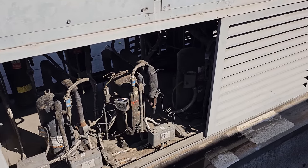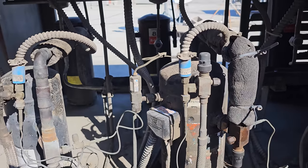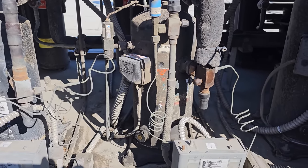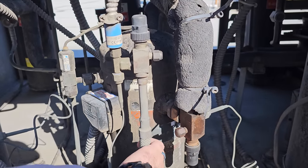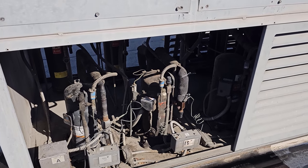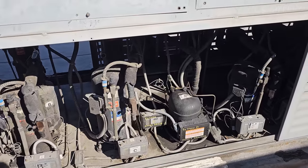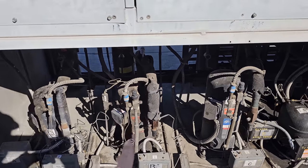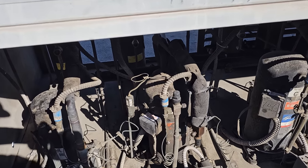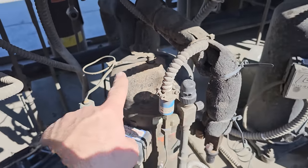It's daytime — I'm back. The freezer's down to temp; everything's working great. But we're going to try to dig into this. We need to find a refrigerant leak and figure out why the fuse blew, and maybe investigate that low suction pressure. I came out here last night and this compressor was off on thermal overload. Right away I was concerned because the whole head of the compressor — the paint is peeling off — like it's been overheating.